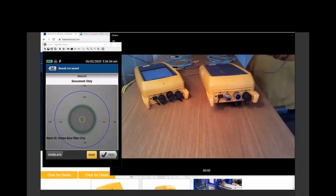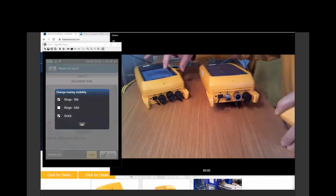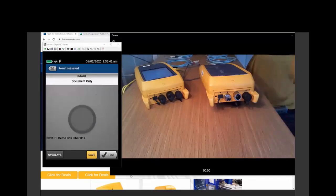Okay, now, a little bit funny looking here, but let's take a look at what we're seeing. Because when we test multi-mode fiber, we want to overfill the fiber. The core of the fiber in my source is oversized so that I can overfill the fiber. But what I'm looking for right now is I just want to make sure that it's clean, and it is. That's a beautiful looking fiber. We are ready to go.